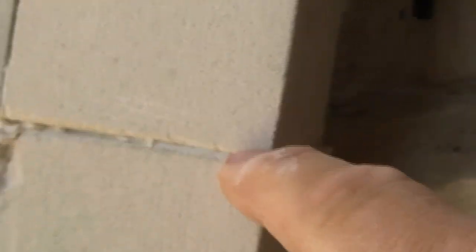Been doing some work on the edges of the stone, starting to get these flat. When you put them in they don't go in exactly. Just finishing over the top with sandpaper — I've got a little bit of filling to do. There'll be a ridge in here to show the clear split between the top and the bottom rock, but this line here we're going to start to close in, primarily because I don't want any damp to get in there when it rains or when it snows in winter. So I'm going to do a mix of mortar and start to get some of these stones fixed in and just work out both sides.